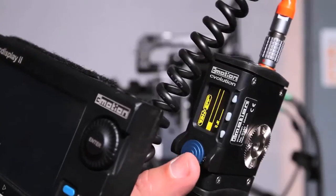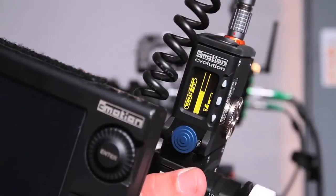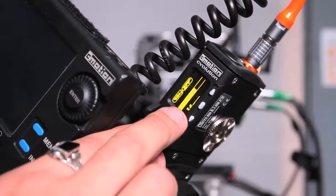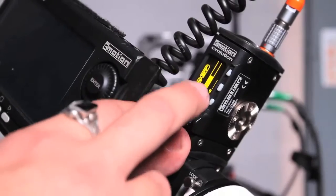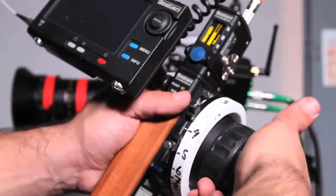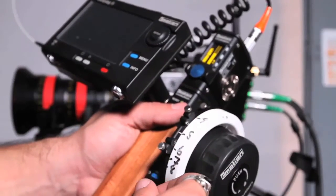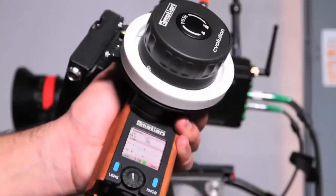You can now see the gauge moving up and down. You can adjust the speed of the zoom right there, and there's a zap button — even though you're at a really slow zoom speed, you can hold down the zap button and it'll move at full speed so you can get from one end of the lens to the other really fast. Now that the motors are calibrated, we can mark our remote. Some people like the focus to increase going one direction — in this case the marks are incorrect, so we need to change the direction of the motor.